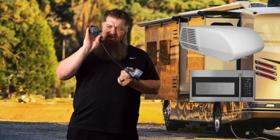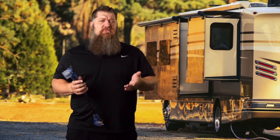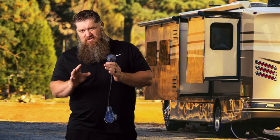When you are used to 50-amp service and you hear you can only run one AC, that may be the case. But if you turn on the microwave at the same time your air conditioner is running, you have potentially overloaded the circuit. Your microwave draws a ton of power — up to 1,500 watts. On a good hot day with your air conditioner, you can pull over 2,000 — maybe even 2,300 to 2,400 watts. So now you're well over what this adapter can actually handle.